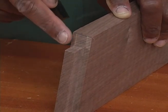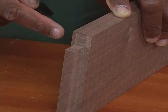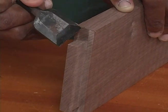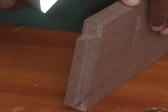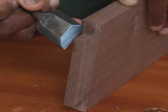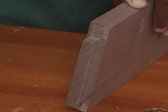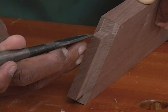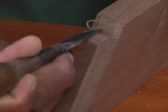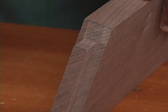That wood directly adjacent to that edge, when chamfered like that, will support the cut when it exits and control that blowout to a large degree. One more chamfer here on the edge — that will also help when we're trying to ease that tenon into the mortise. And then the last one will be right here along the grain going back to the shoulder of the tenon, just like that.